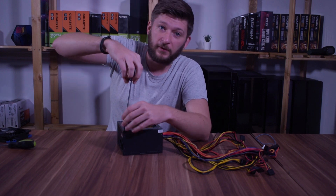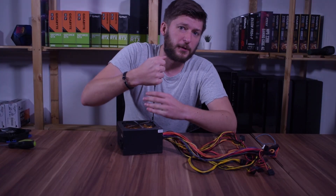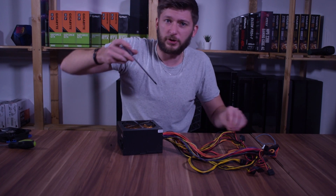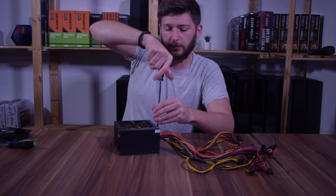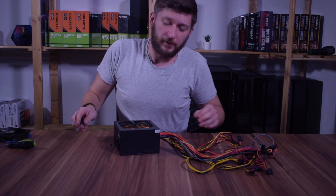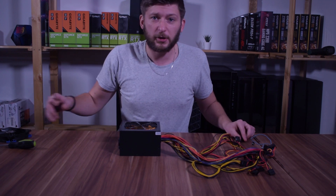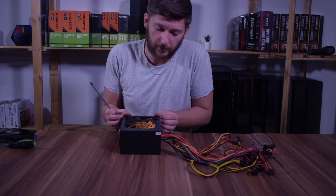While I'm working on this, a few important things: do not repeat this. This is dumb. I am doing this because I have nothing else to review right now. The usual power supplies are not that hard to open — just a few screws and the metal cage should come apart. Now, an issue is that power supply fans are usually run with only a positive and negative connection, so a 2-pin. And this Noctua fan I have right here is a 4-pin PWM connection, so it is run with a pulse.